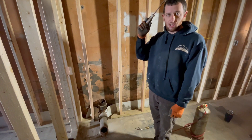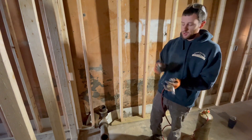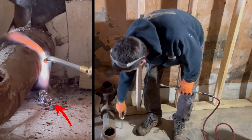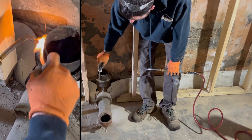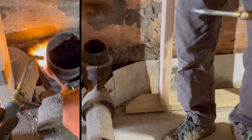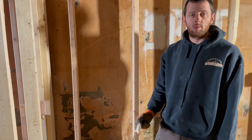I got my safety glasses, I got my acetylene tank with the turbo torch on it, and I got a screwdriver to pick the lead out. When you do it horizontal, the lead is going to fall out on the floor. When you do it vertical, the lead's just going to sit in there because there's oakum stopping it from going down, so you've got to kick it out and brush it out as you're melting it. You can use a flathead or a cleaning brush.